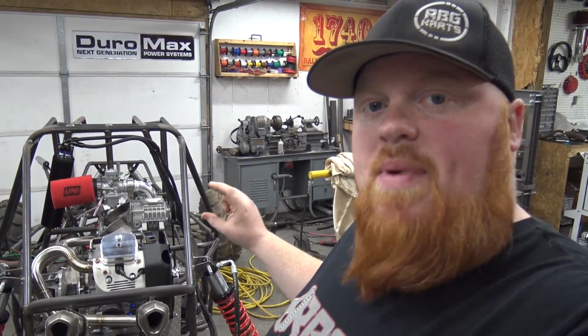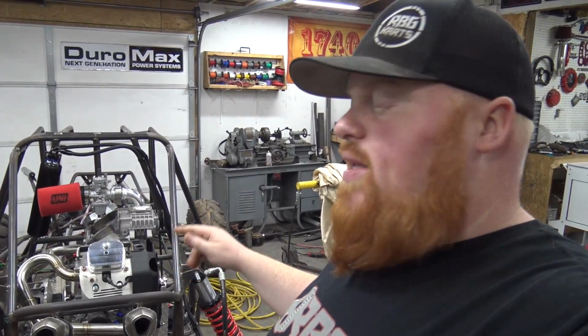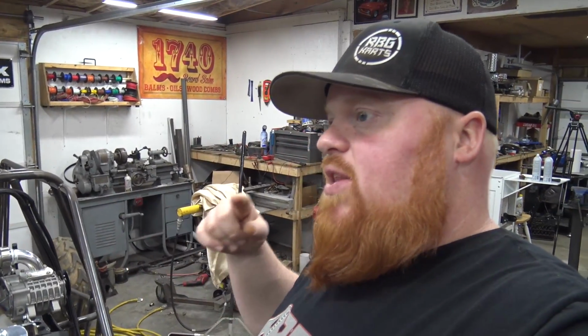So in the next episode, you're going to see me make that connector that hooks the supercharger to the intake. You're also going to see me do the tensioner. I got to build a whole new tensioner setup, and that sucks. So this was hours worth of work that we had to redo, but dude had a better idea. And he was saying that our pulley was in the way for our charge pipe or intake, and that wasn't the case. It was just better to mount it that way. With a draw through, you want everything downhill if you can to help from fuel pooling.